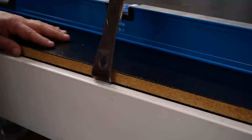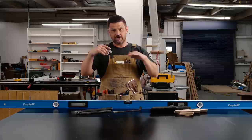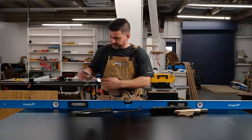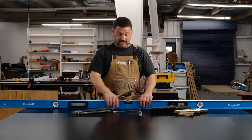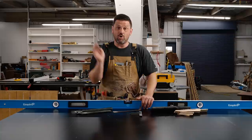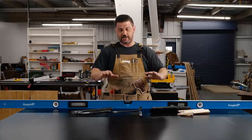I took three-quarter inch plywood strips and put them around the tabletop to give me shim locations. Then I took a straight edge, looked for gaps underneath it at the two points of contact, and shimmed accordingly. Once the table is flat, you can measure your rails off the table surface. I'll take a combination square set to about two and a half inches — since my slab is about two inches thick with a little twist — and pull my rails up off the table surface and nail them to the edge.